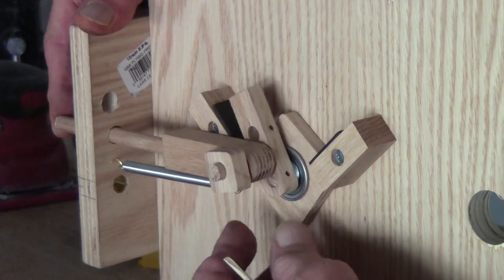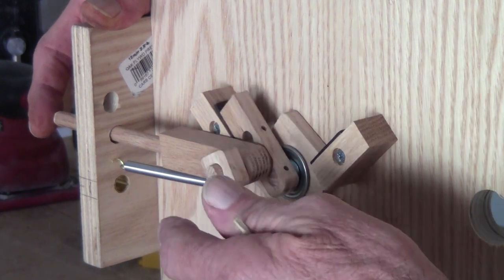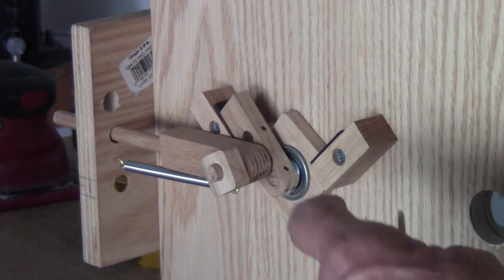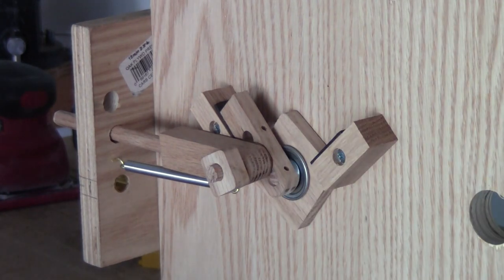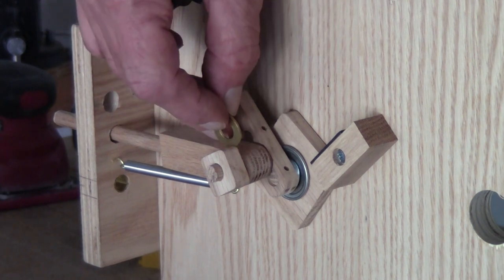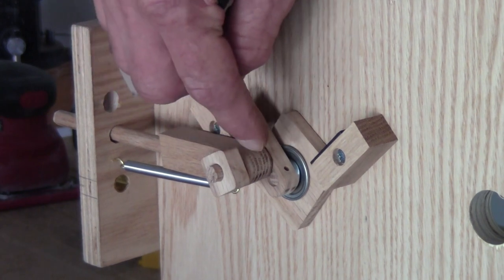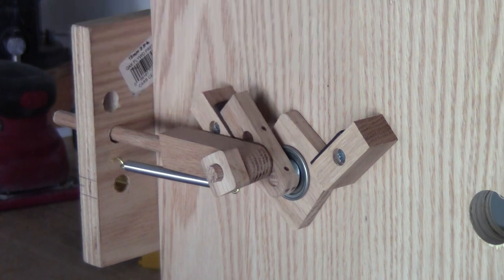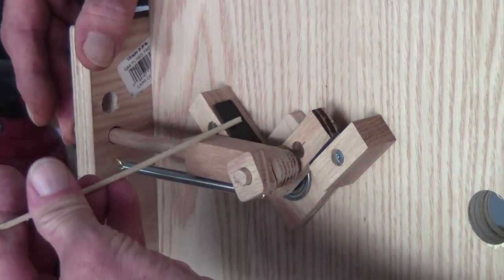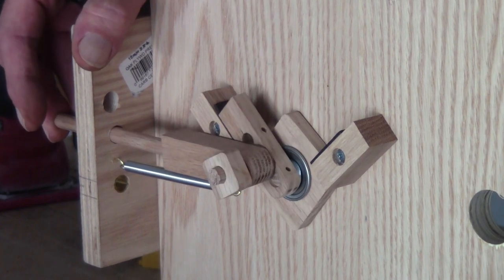That's okay, because once I get it all strapped in, it's gonna be really good, really smooth, but it'll have enough play where over time it doesn't heat up and start creating friction. So what I did is I got some brass washers and I put one in here and one in here. Now there's a brass sleeve that goes through this part that rotates inside there, so that'll keep friction low. I got a rubber pad here and one here, so it doesn't make as much noise when you're using it.